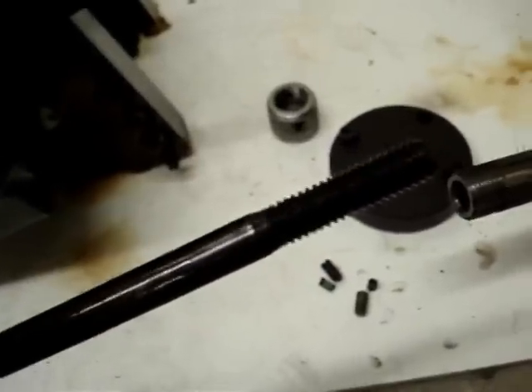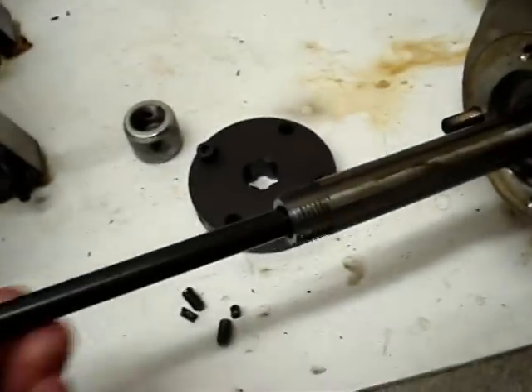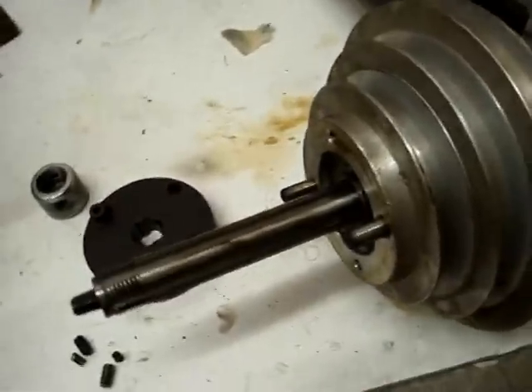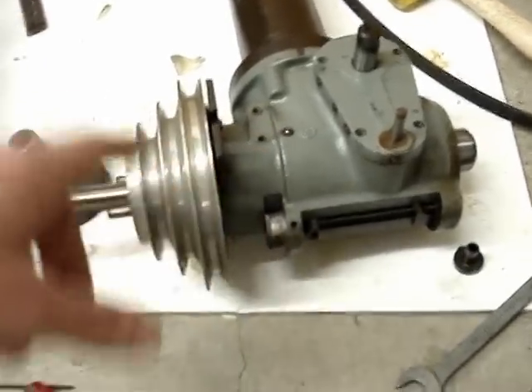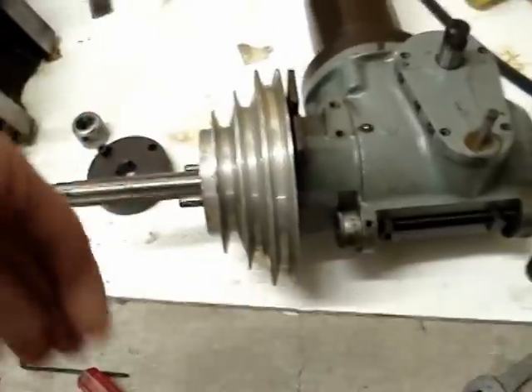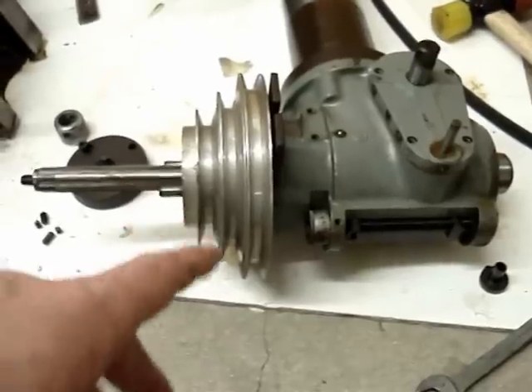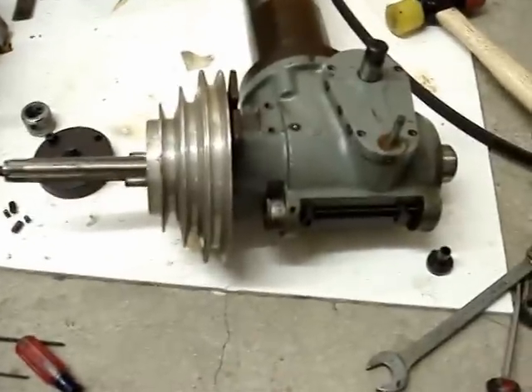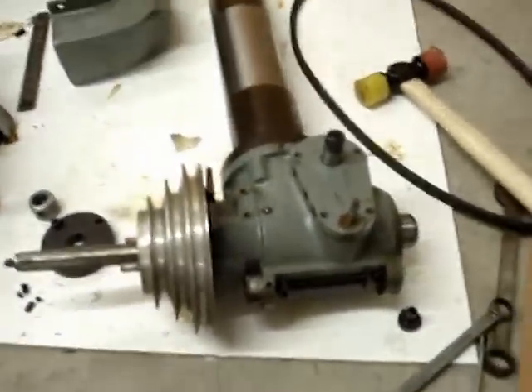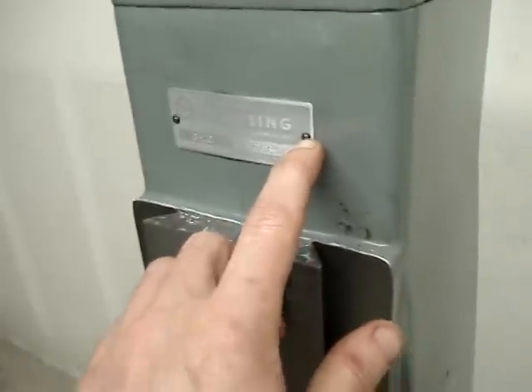You can see I've got the top plate off with the drawbar and its 3/8-16 threads. I've also ordered new bearings for the cross slide tables, which I'm going to install. I don't think I'm going to replace the bearings in the head, because when I bought the mill the previous owner checked it for me and it was only out two tenths total indicated runout, so there's no need to rip the head apart at this point.